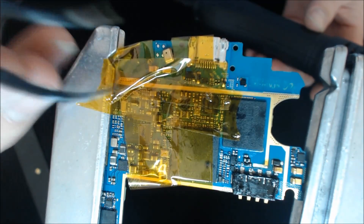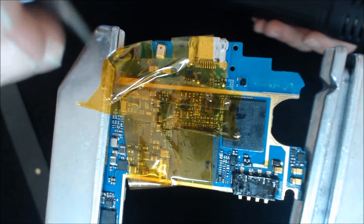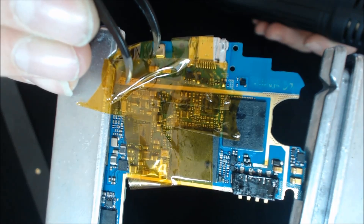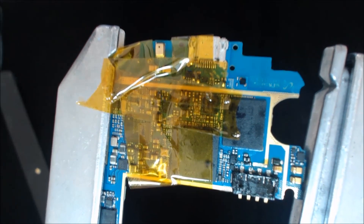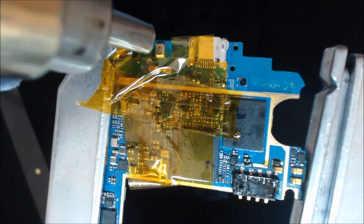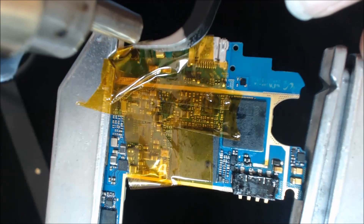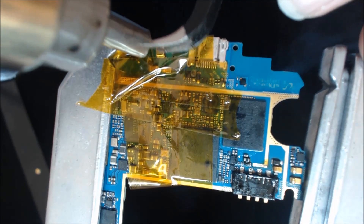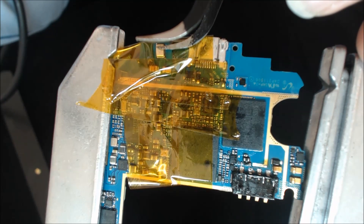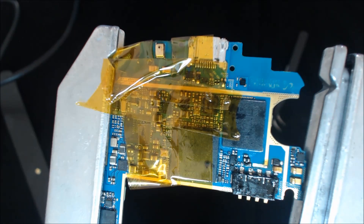I'm going to go ahead and line it up on top of here and kind of line it right up into where the old one was — it's pretty much got guides on the corners. So now we're just going to heat this up a little bit again. Once I get this hot enough, I'm going to take the head of my tweezer and kind of push down on the top of it very gently, to adhere it with the solder. Then I'm going to pull the gun away and keep this pressed down — you can blow on it too, it helps.